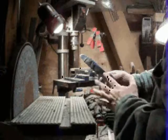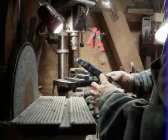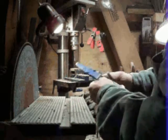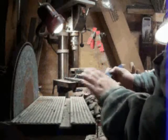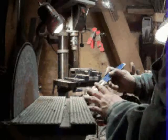So I would make sure that this side fit tight against the guard, tight against the tang. And I would glue that on tight, epoxy it on tight, and then when it hardened, then I would drill through my holes. Then I would fit this side, glue it on again, and then when it dried, I'd drill back through the knife and then pin it.